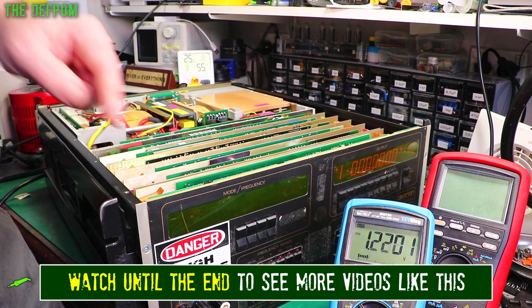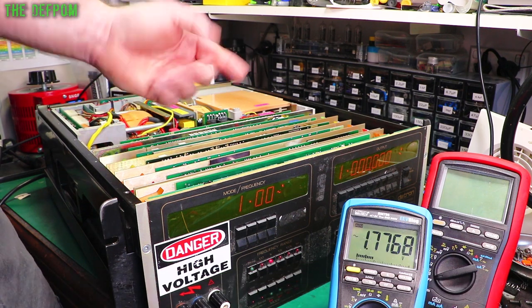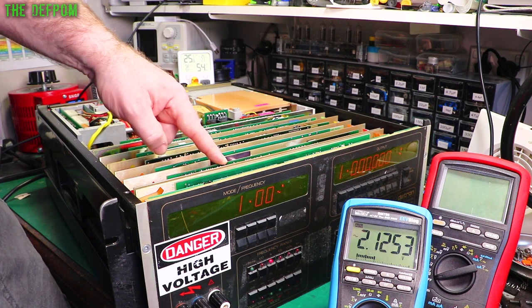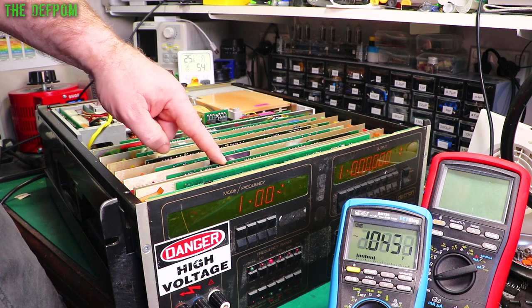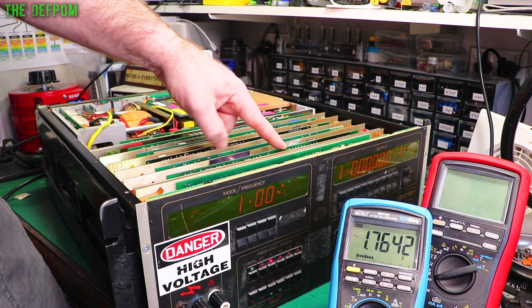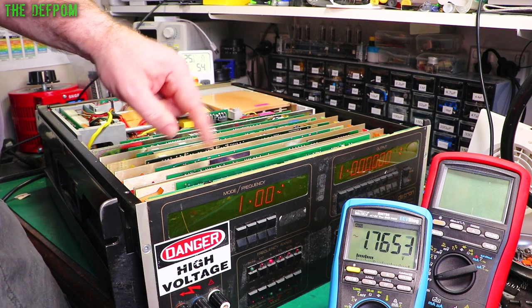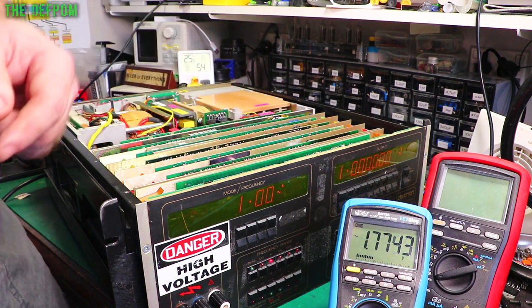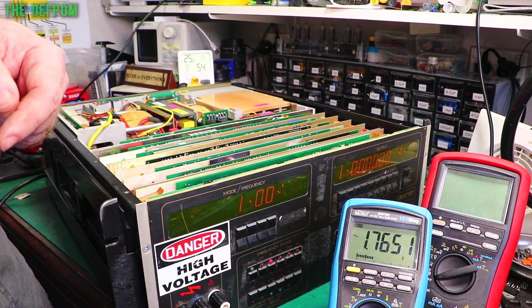Yeah, that ain't right. And if I demonstrate the same thing on AC volts as well, same setting, see, it jumps up to over 2 volts. So there's definitely something going on here. It's not from touching the shields, it's not from that. So I don't know, there must be a bad connection on this board. At least we found something.